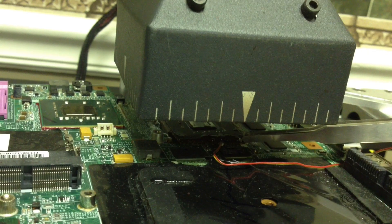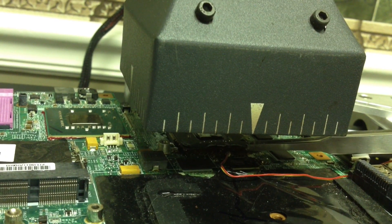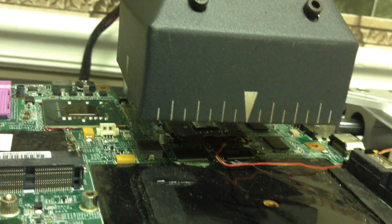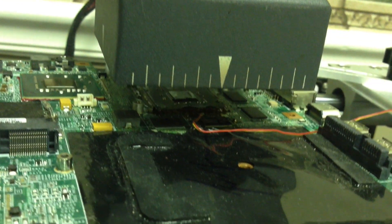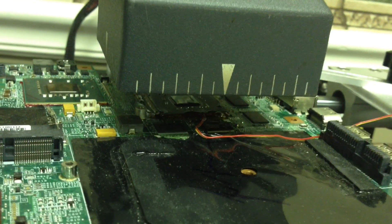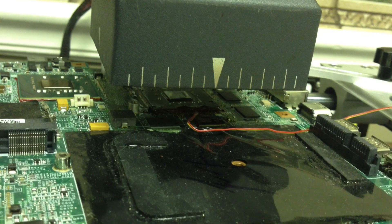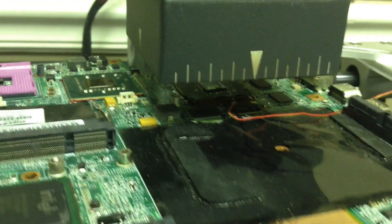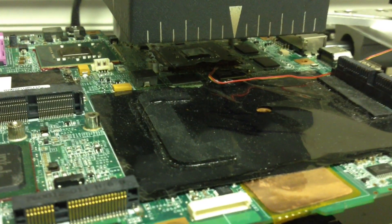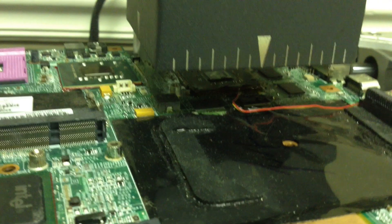What I'm going to do is corner bump — just check and see if it's loose, which it's not. It's going to need a little bit more time to actually loosen up. Bumping it in the corner will let you know if it's loose or not, but you have to be really careful because the capacitors can be moved or damaged that way. This is just a scrap board so it doesn't really matter — we're actually harvesting this chipset to use on a different system.